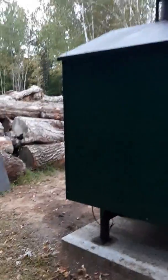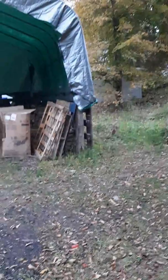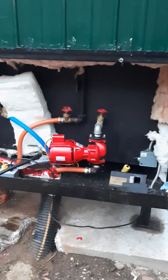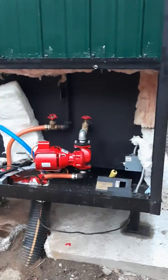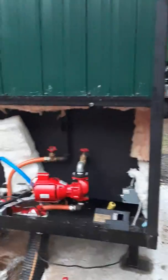The Taco 007 can't handle the additional zone up top, and whoever set it up configured it so the one zone going into that far right room feeds first — it goes to the line of least resistance. That's why it doesn't really feed the top zone until the bottom thermostat kicks off. I need to get a new pump, maybe a Taco 011 or 013. You can go online and check the pump curves. I just changed this pump today and put one of these in the house — before that I wasn't getting flow anywhere other than the main plenum with the water-to-air heat exchanger.